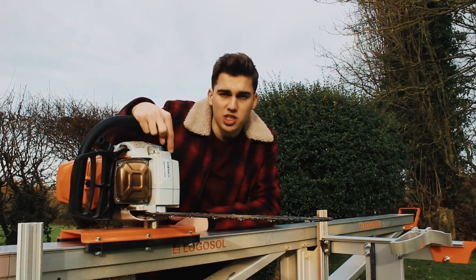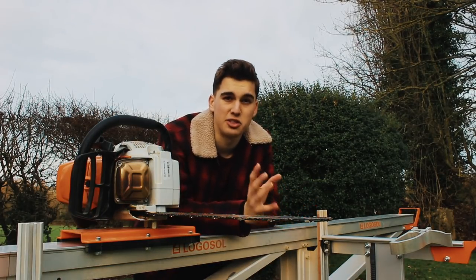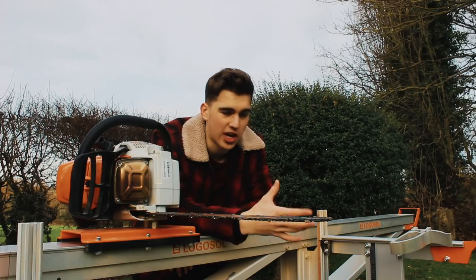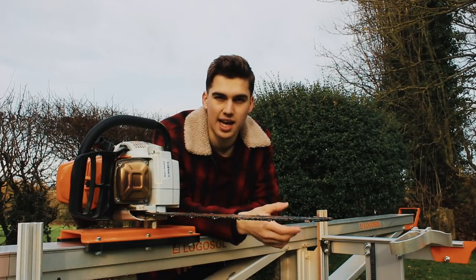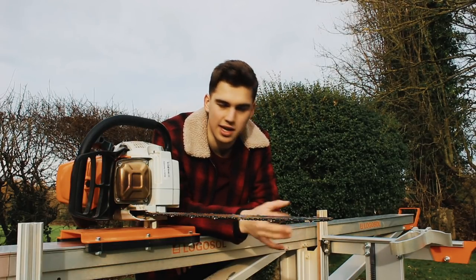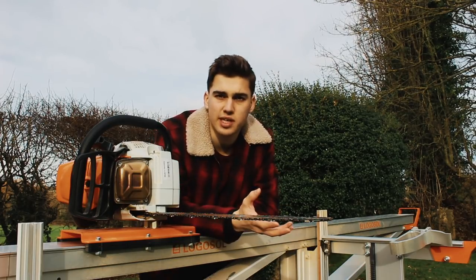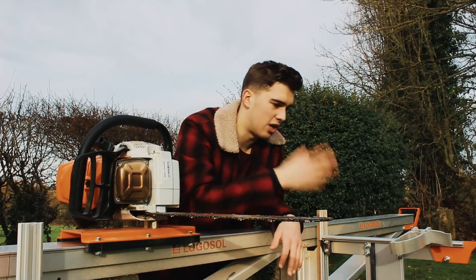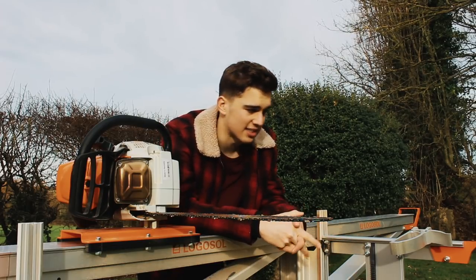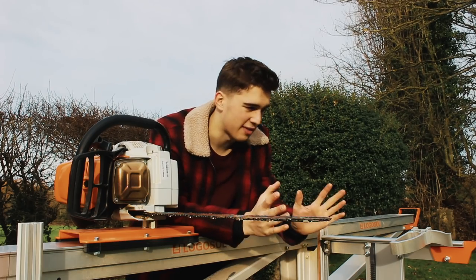With this chainsaw I have put a ripping chain on — I'm pretty sure that is a must. I've already sawed up the ash and the surface from the ripping chain is very smooth. My experience before using the sawmill was that I thought a chainsaw cut is the roughest thing you can get, and that is true normally with a crosscut chain when you fell a tree — it's very rough and you can see the lines. But because this is a perfectly flat jig and you're using a ripping chain and the log is securely mounted to the log lifters, it basically cuts perfectly straight and it's ready for sealing. So if you're worried about the slabs not having a smooth surface, you don't need to worry — the surface is very clean.